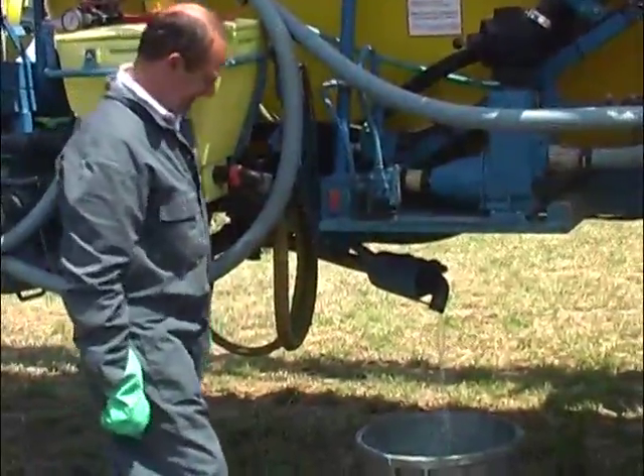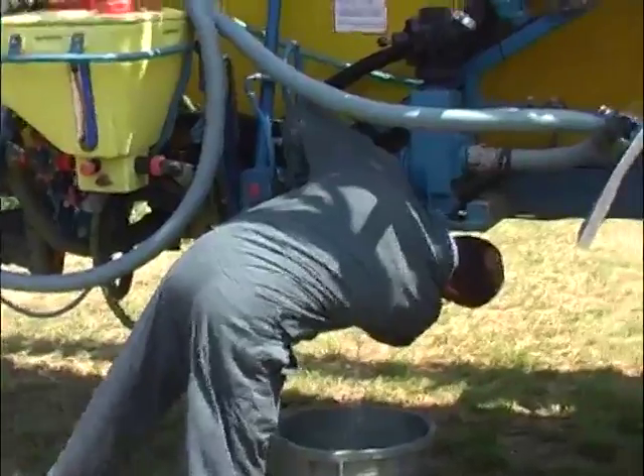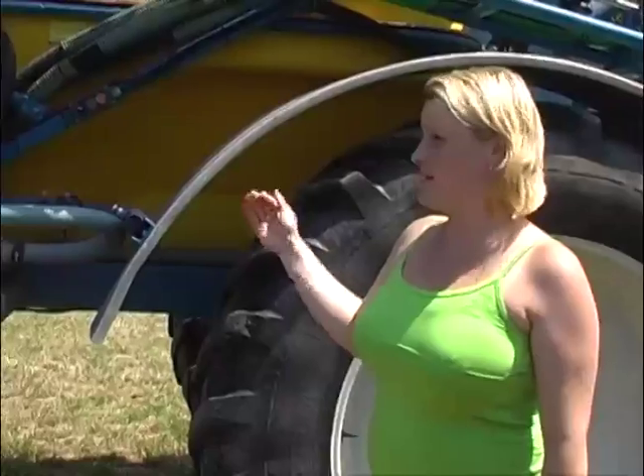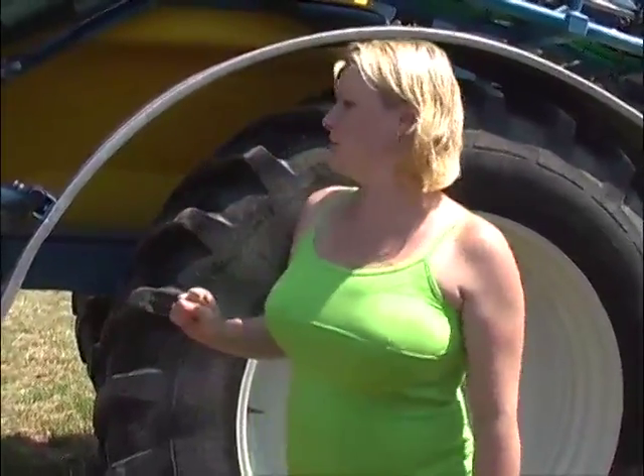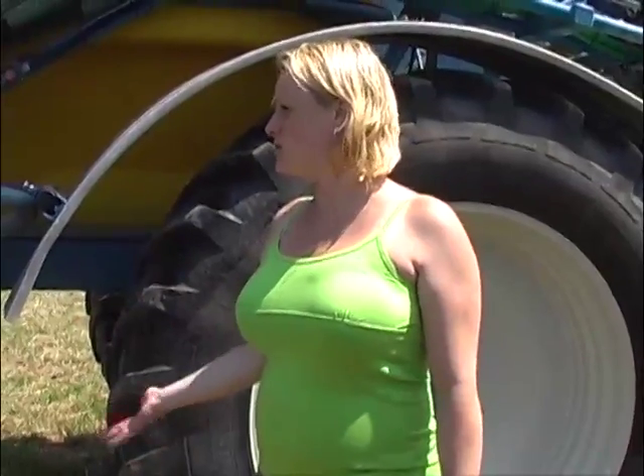This is the amount left after air comes out of the nozzles — the spray tank is completely empty according to Hido's computer. He says he's blowing air from the nozzles, so his sprayer is empty. But as you can see, if a farmer does not clean well or assumes nothing is left and opens the tank, there are still 30 to 35 litres remaining — still highly concentrated product. So it's very important to take care of this residual volume.